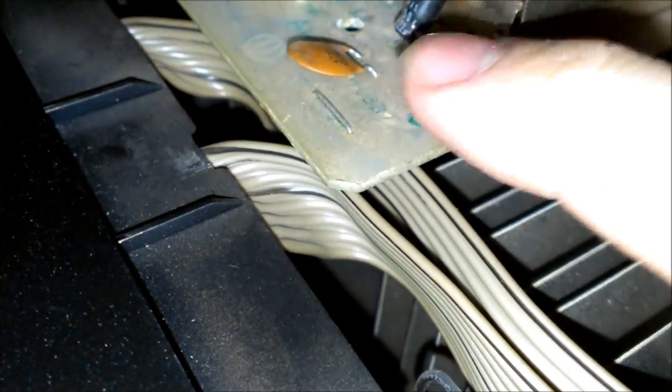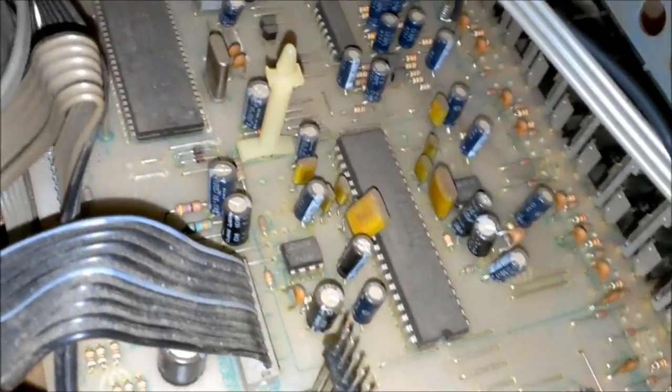Real simple. And to get this off, this little wire piece that actually went on one of these studs here on this one, just take a flathead. Where'd it go? There it is. And just wiggle that up off in there and pull it off. Either that or you can desolder it from here to the chassis. And now we're left with the audio board, and the video board's actually underneath it, but nothing's wrong with the video. There's probably a cold solder joint somewhere under this board.